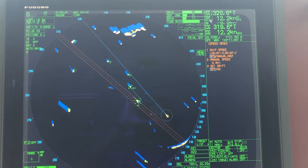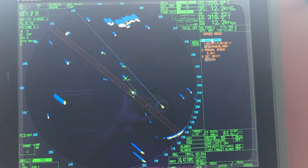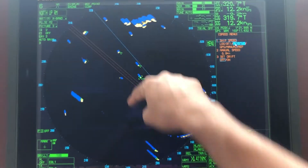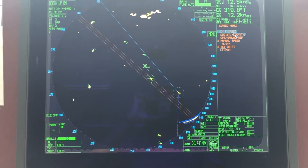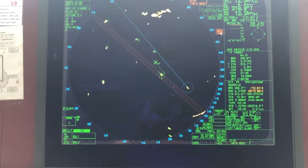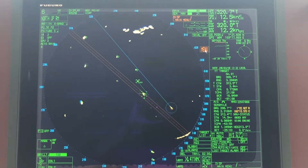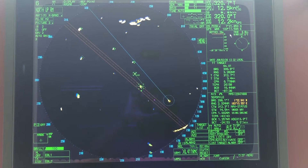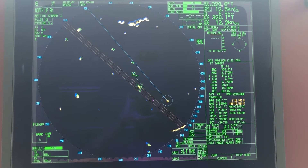Take your cursor to Speed Profile at the top of the screen, right-click, and highlight Ship Speed and Water Log. See what happens to the picture when I change it — everything changed. The speed is now water-logged, and the speed over ground is 12.2 from GPS.